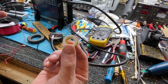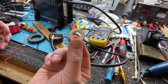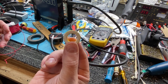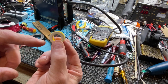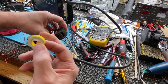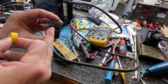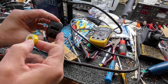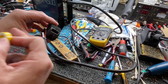I know you can't saturate it easily — or you can saturate it and burn it up, but you'd have to probably put about 500 watts through it. Because they've got an internal air gap structure — like the gap here on this one is acting as an air gap structure — if that was closed up, it would have massive inductance and there's no reset mechanism and it'll get hot.